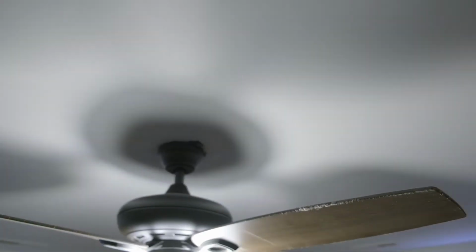That's the hole, my little pilot bit that I drilled, so you can see it. I'm roughly about 25 inches from the wall. So the ceiling fan is right here. That's what I seen in the attic. So what I'm going to do is go 14 inches this way, 14 inches over, and make the box like that. So, I'm tired. I haven't done this in a while. So actually, that's a good pilot hole right there.